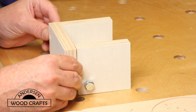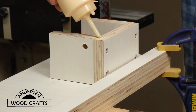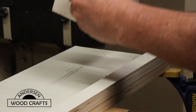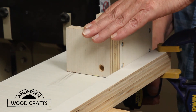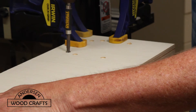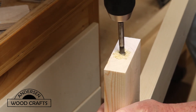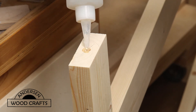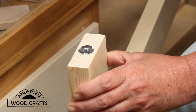The mechanism is basically just two pieces that will hold the leg, and then another piece at the front that will be a stop so the leg won't continue to travel. Then I'm going to attach the hinge mechanism to a piece of plywood and then attach that piece of plywood to the bottom of the table. It makes it much easier when you're building something like this — when you can build it in modules and then put the modules together to make the final piece. I also made sure that I cut the legs a little undersized, so I'm drilling to put a T-nut in there and a bolt as a leveling foot. To ensure that the T-nut stays in there, I'm also putting some CA glue on there — I have never had one come out that I have super glued in there.